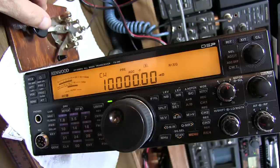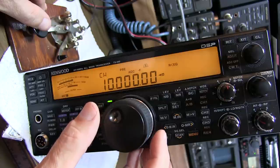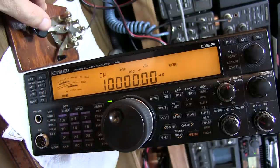If I key the radio, you can hear a slight wavering in the signal, because those two 800 Hz signals are not exactly the same. We can hear that more clearly if I adjust the frequency on the radio. You hear that beat is going really fast now, and then slows down. Ideally we want that beat to slow down to the point where it's not moving at all — that's when those two 800 Hz tones are matching each other, and the reference oscillator will be exactly tuned properly.